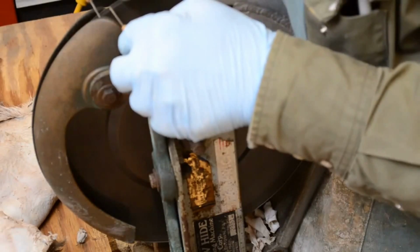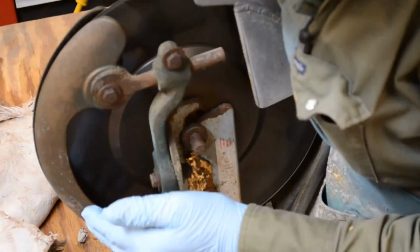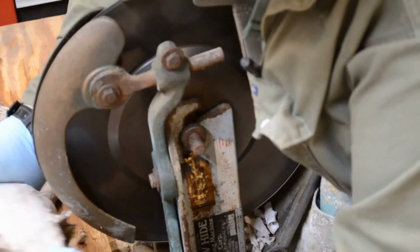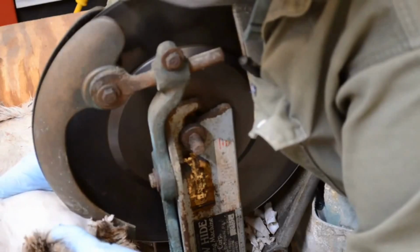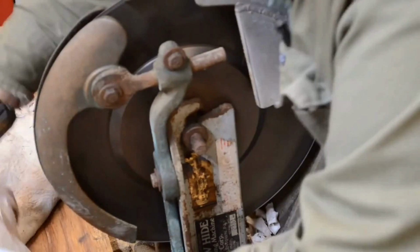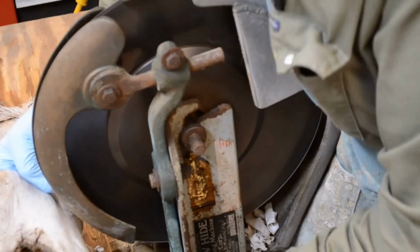By the way, the guards are set to what are called close. They're close together side to side, and they're close forward and back. There's just a small portion of blade that is exposed at the bottom of the guards. And that exposed portion is one of the reasons when you get a hide back, you need to get in there with your knife and shave the crown down by hand. It really doesn't pay for the shaver to put their hand under the hide and try to get to the very edge. Some guys do, some guys are adept.